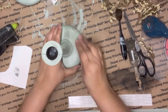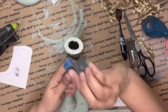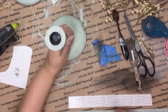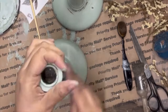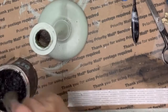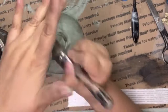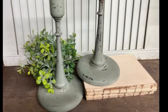For the rest of the piece I'm coming in with my 220 grit sandpaper and giving it a full sand down. Latex paint usually distresses a little differently, and this one pulled off a bit too much paint, so I came back and added a little more green paint, then repeated the process on the other candle stand. After I got the distressed look I wanted, I came in with some DIY dark wax to age up the piece, add variation in tone, dinge it up a little, and then wiped off the excess. This project is complete.